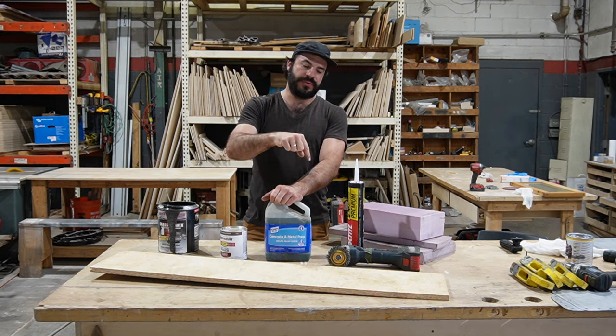So just to recap, we start with our wire brush floor. If we're using the cheap Rust-Oleum primer, which I don't necessarily recommend, you want to treat it with phosphoric acid first. If not, go with the chassis saver. You can go straight from your brushed rust to this. Once the chassis saver is dried, you want to grab your Loctite PL, the foam board, Foamular 250 XPS extruded polystyrene in the thickness of your choice. Use your PL to glue down the foam board and your PL to glue down your tongue and groove Advantech 3/4 inch plywood subfloor or OSB subfloor on top of the foam.